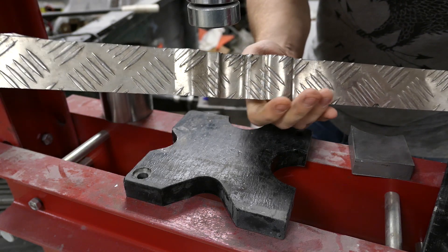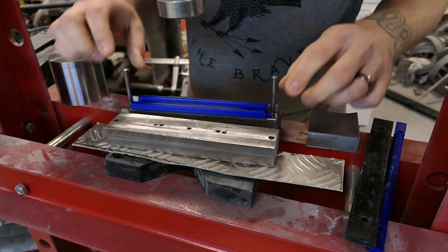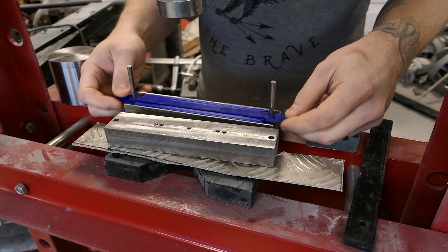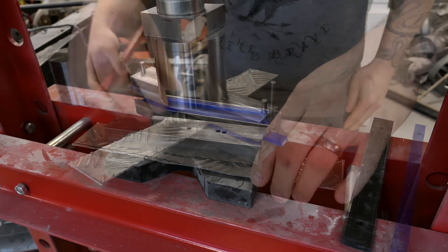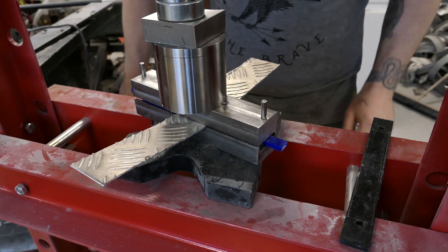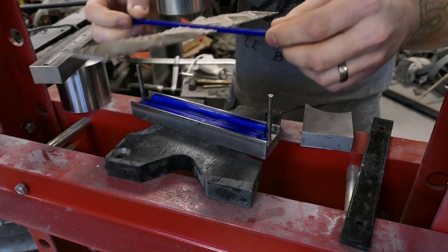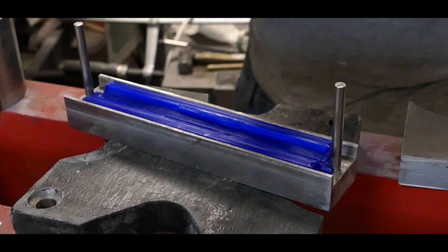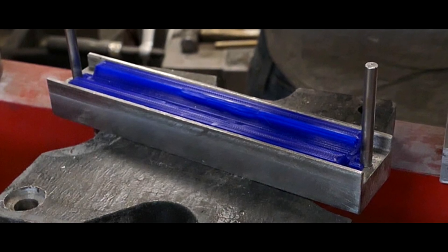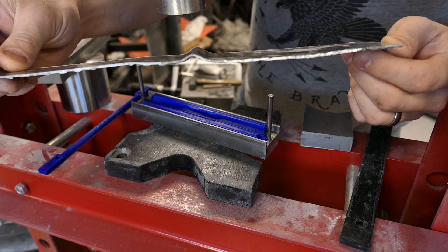It's not very parallel to the previous shape since I did a poor job aligning it. Testing implementing more of a shape on the lower part to force a tight curve into the checker plate — I skimped out on the infill on the lower part, so I suspect this will be a one-shot die. The upper die is the same as last time. I designed these dies to have a gap of roughly the thickness of the checker plate, so the plate can actually follow the curve. There is some damage on the lower die, but actually less than I expected — I can see some limited layer shearing, so a hotter print with slightly higher extrusion temperature would probably make it hold up better. Using these dies results in a much more defined v-shape with a slight radius.